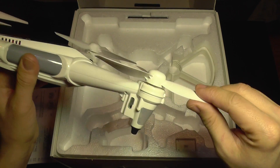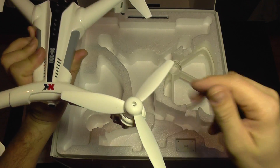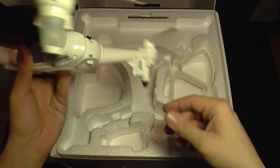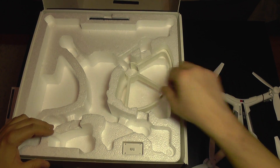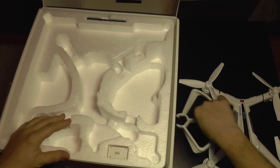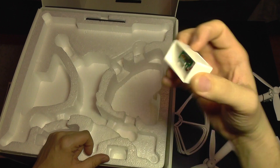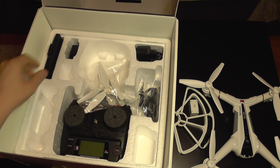The props also look interesting — they have a pretty high pitch and they are brushed, but there's not a lot of cogging sound from the gears, so I believe this will be a lot less noisy than other models. In the box we also get prop guards which are snap-on quick guards, so attaching them will be very fast. This will use its own proprietary battery as you can see from the adapter, and this is the FPV antenna.